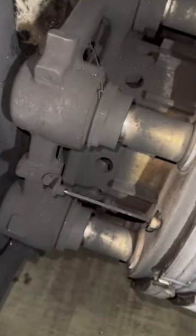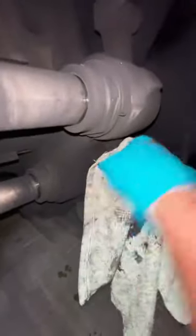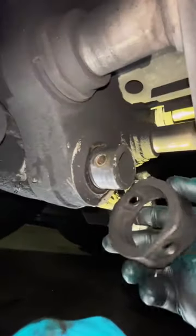This is what most aircraft brakes look like. That pin right there is the wear indicator. Right at the bottom you will see an anti-rotation pin — this is a very important component as well as an RII required inspection item. That right there is the brake temperature sensor, which I'm pulling off — it's a cannon plug electrical connector. Right above that, which you will see later, is also a hydraulic fitting that supplies the brake with hydraulic pressure.